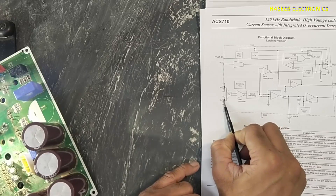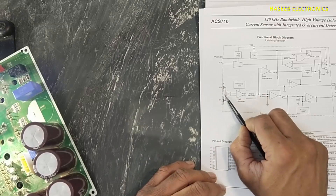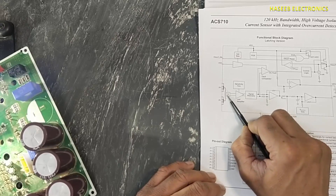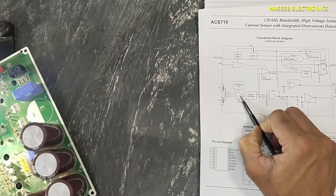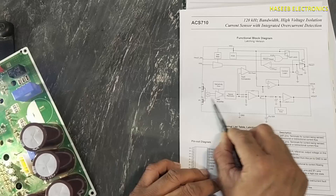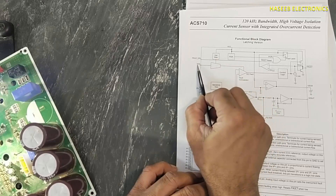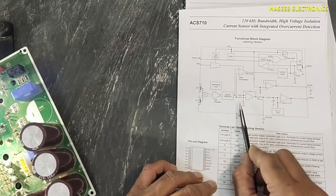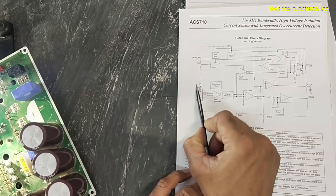Because it is using a magnetic medium, it will not dissipate too much power. Proportional to this current, there will be a magnetic field. This magnetic field will cause the Hall effect sensor IC to conduct. Then the Hall amplifier will amplify the real-time amount of current and give output. First it will receive the enable signal VOC.